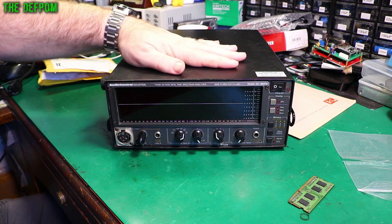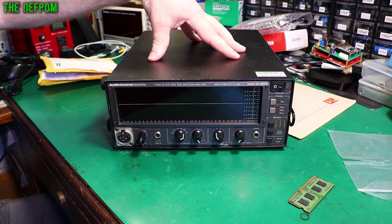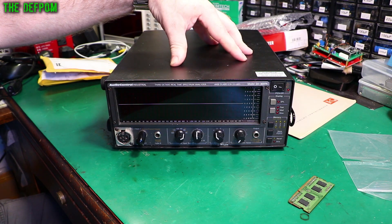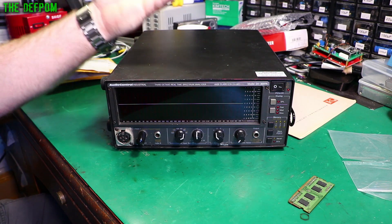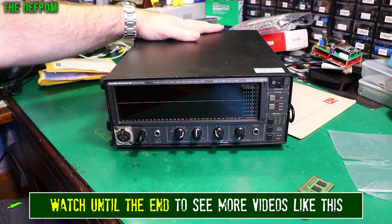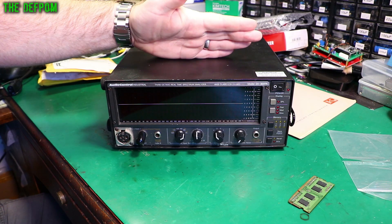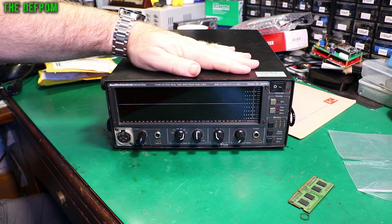It's got a voltage comparator. If the voltage is about 4.2 volts, it'll start to load them up with these resistors, which helps to balance them - just by making them all float around the same voltage. So, this is the device right here. I did a video on this thing probably about two years ago. This was broken; I did a video showing me repairing it. There's an option where you can have a battery pack installed, and this one actually had a battery pack originally. Someone had taken it out, and it was basically semi-stripped out.